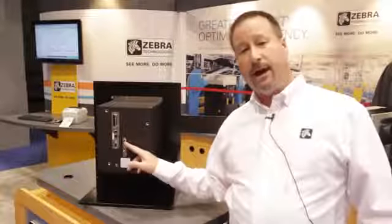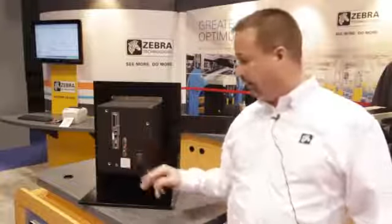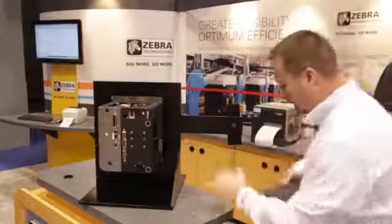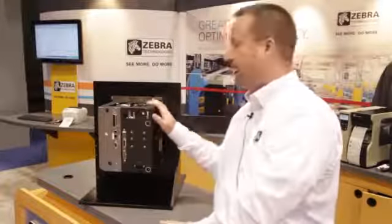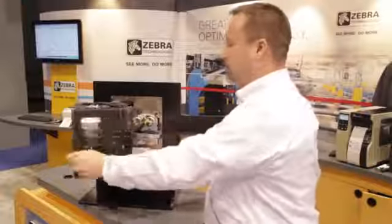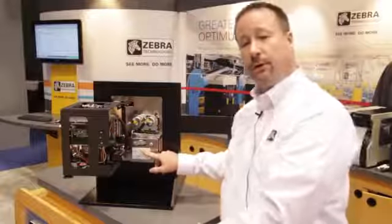The applicator I/O is now the same I/O for 5-volt or 24-volt — it's just a matter of easily moving jumpers to convert it from one to the other. There are still no fans in the unit, so the lack of perforations is key to surviving a harsher environment. Taking the back off gives complete access via a cage system that swings open very wide to give access to all power supplies, circuit boards, wiring, and the new modular drive system.